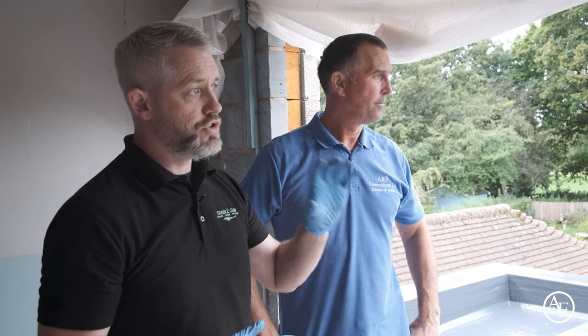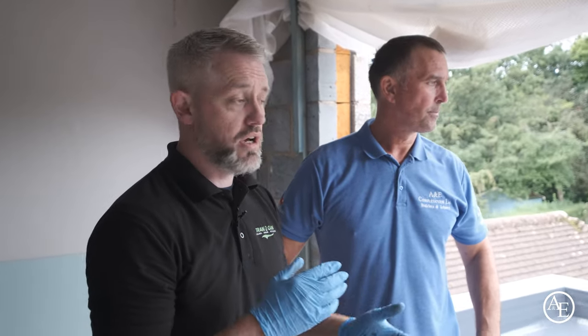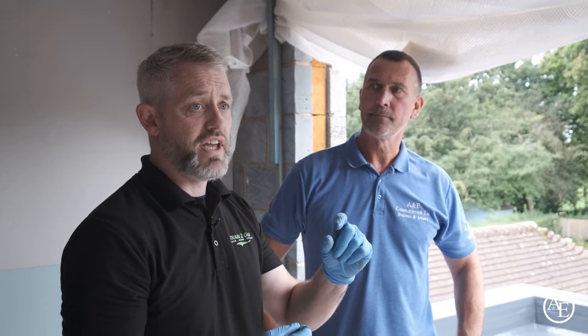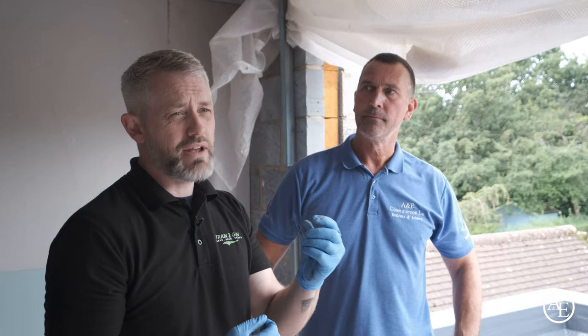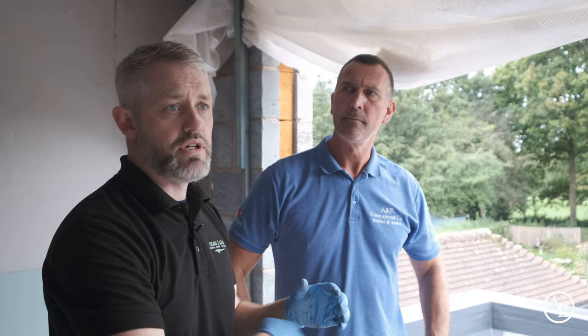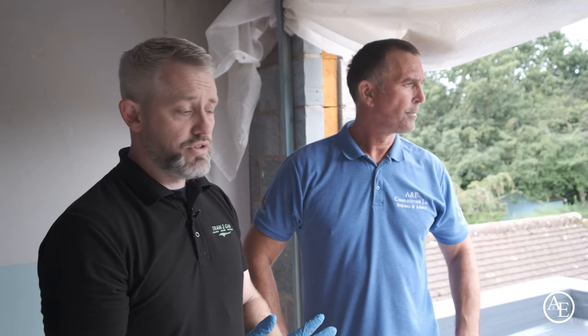We've just finished putting the top coat on. A few key pointers: you want roughly two to three millimetres of product. Any more than that and there's no reinforcement in it, so it could crack. When doing your upstands, put the resin on the upstand itself and spread it out — don't absolutely load it or it'll pour down and leave you with runs. Do your upstands and perimeters first, get all your upstands done, and then all you've got to do is your main open areas, which you can easily do in a short time using a seven to ten inch roller.